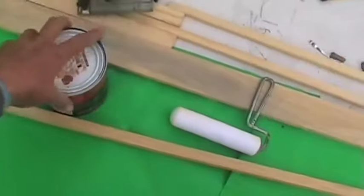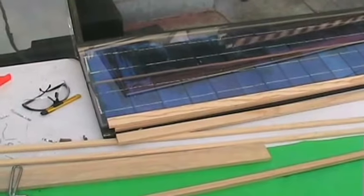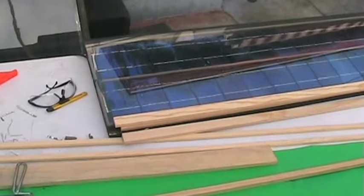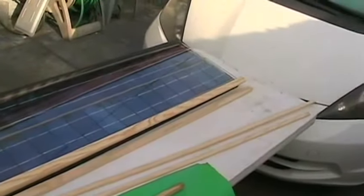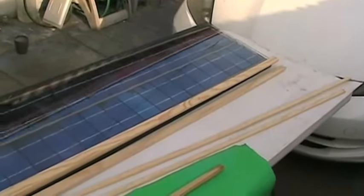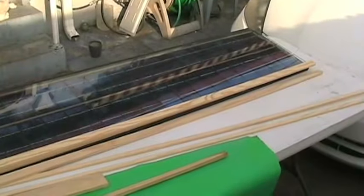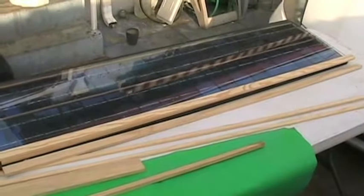So what I'll do is paint these — I've got some leftover exterior flat paint, paint and primer in one, that's gonna save some time. It is a brown color, but it might match better with the roof shingles being brown, so it's even a plus. I've got to paint the back of my piece of wood too. First I'll put it together, then I'll flip it over and paint the back. I'm also going to put some rubber feet on the back to stand it off away from the shingles a bit and give it a little air space.